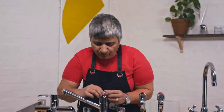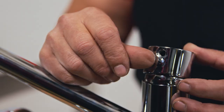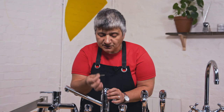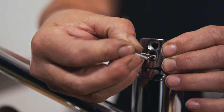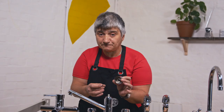This cap will pop off — be careful not to lose it, so I'm just going to put my thumb underneath it and just pop it off. There it is. And you'll see the hole. Inside there is your allen screw that holds this onto the tap — it's a two millimetre allen key you need. Put it in there. It's very fiddly but you can see I've got it in there now and I'm undoing it anti-clockwise. Be careful not to undo it too much because otherwise you'll lose it. A good tip is while you're undoing it, wiggle the thing, and when it's loose enough to come off, stop. Then you'll see that the allen screw stays in and you're not going to lose it. Put those to one side.